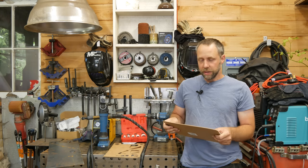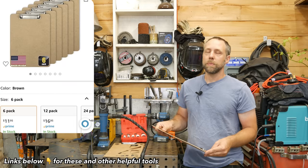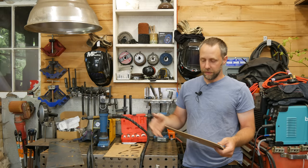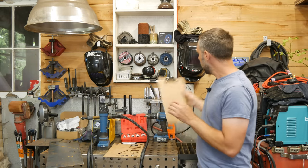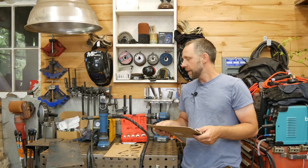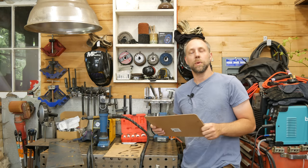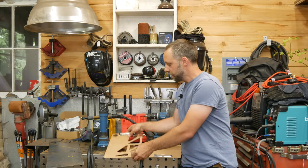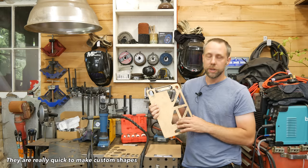The reason I used simple clipboards is I've been trying to come up with ideas for my subscribers for a long time for making really simple guides you can just grab to cut out some parts and pieces. I didn't want to buy a giant sheet of masonite — I just didn't need that much. I was at work one day and I saw a clipboard and I was like, yeah, that's probably the proper material. It's really smooth and tightly compressed. I found these in a six-pack on Amazon for about 12 bucks. Also, I'd rather have a non-conductive material so it's not arcing on the edge of the plasma tip, and ultimately they're going to be throwaway at some point.